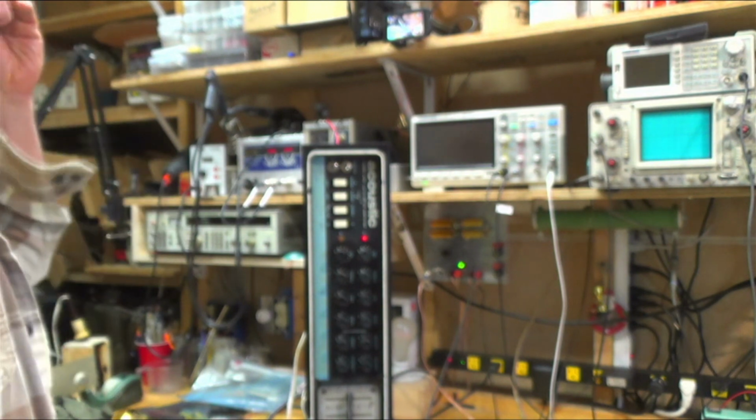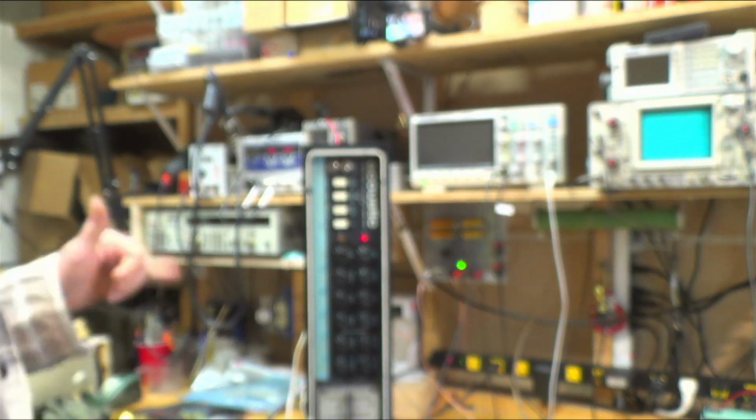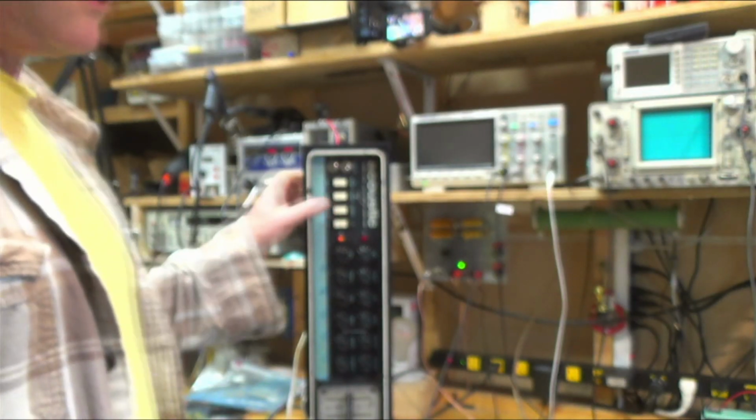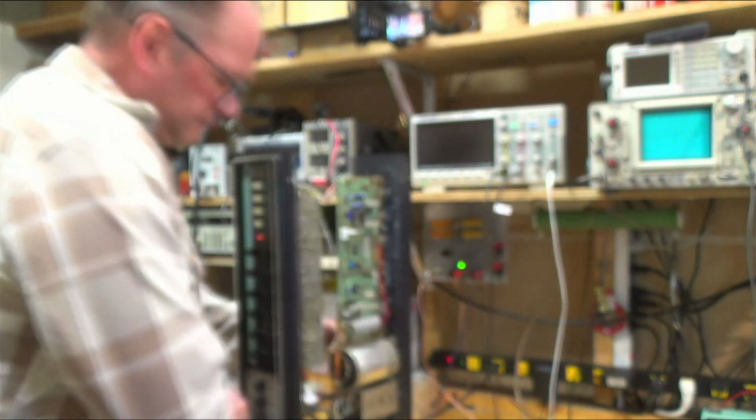And that transistor I put in there is 120 volts, where the one that was in there before, that MPSA06 or whatever it was, seemed to have a lower voltage rating, although they both have the same current rating. Well, that's great. The only thing we have left on this guy, we're going to replace this and see if that brings the voltage up in the power supply. And we're going to replace this with a newer capacitor since we replaced everything else. Then we're done. Then I'm going to get my son in here, see if he can give us a demo.